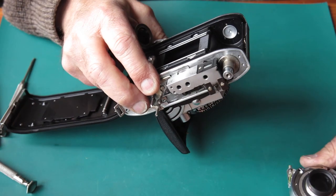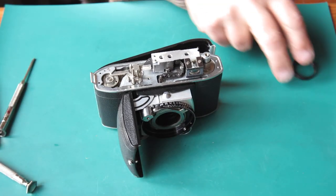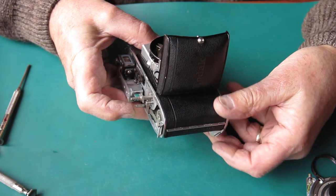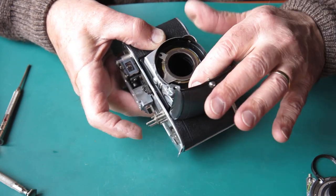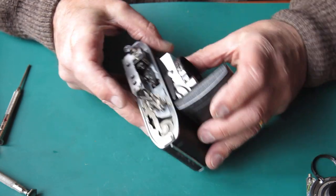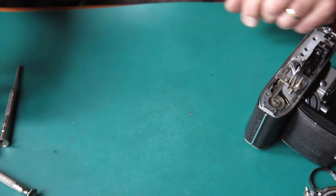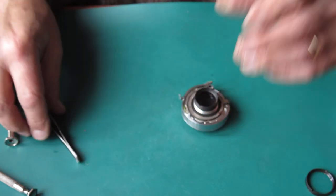The shutter had a funny feel to it. I'll put it aside for a second and check the film advance again. The film advance cocks and would release normally. The shutter looks a bit sticky at slow speed but that certainly looks like it works. What's this piece here that's falling out — a film chip! That could have been jamming something up.